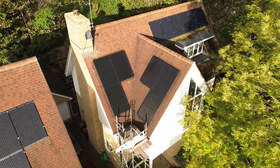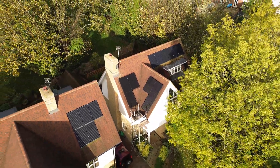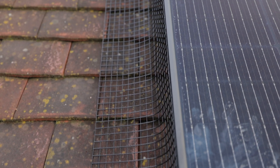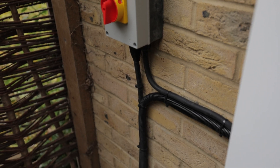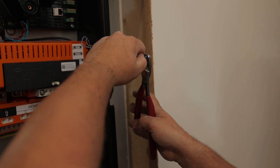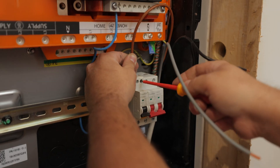Fast forward a week — we're back at the job. Let me show you what we've done. Luckily there's only six panels on the existing system and we've been able to connect into that, so we can just take a cable from the existing panels over to the two new panels and away we go. We've got Enphase microinverters behind each one and bird mesh all the way around. So we've got our Powerwall here outside, our rotary isolator here, comms cable comes in from below. And there she is — this is where we've got the Gateway. This is the brains of the system. If you want to know a little bit more about what this actually does, then watch our other video on the Tesla install.